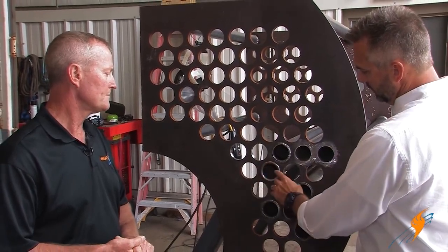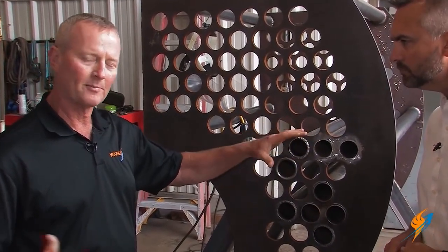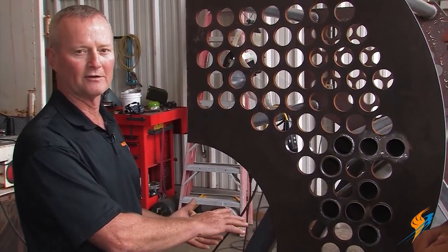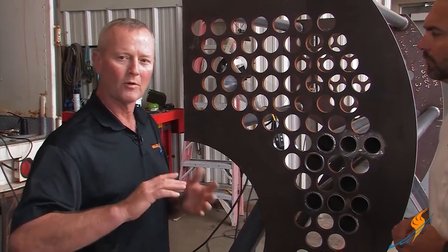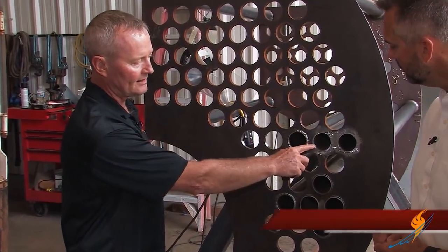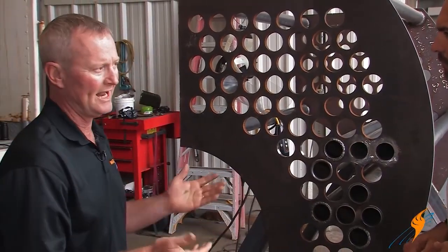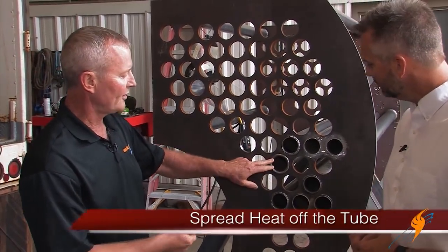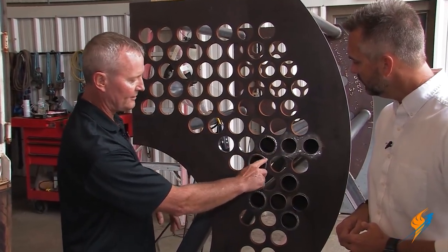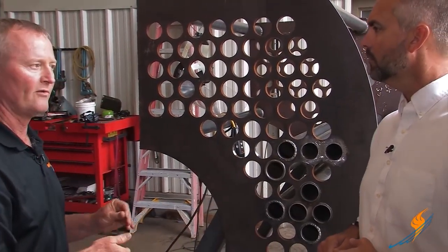So what is the beading for? If you leave that tube sticking out, at least on the hot pass — the very first pass where hot gas from the fire comes through — by the time it gets to the rear, it's around 2,000 degrees. If you leave it sticking out like that, it's going to overheat and start to crack, and eventually crack inside, causing a leak. All beading does is transfer that heat off the end of the tube to the tube sheet. You bead that tube, turn it over, seal it against the tube sheet, and that transfers the heat straight to the tube sheet and protects the end of the tube.